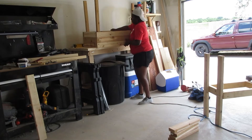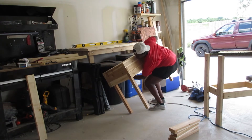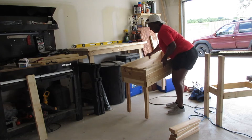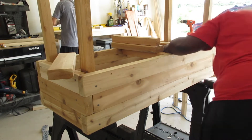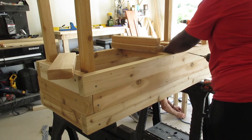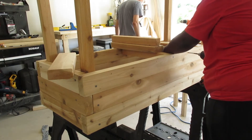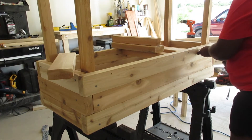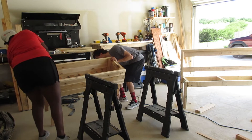I'm finally finished with my planter and it is looking amazing. I just love how it looks and how sturdy it really is. I was kind of afraid that the two-by-two posts would take too much weight, but it's really not an issue. To add the bottom, I got some sawhorses, used scrap cedar I had left, measured out the inside, and measured from the middle, right, and left because those are all slightly different measurements due to bowing.